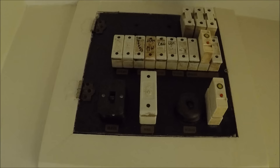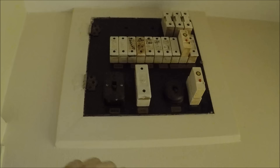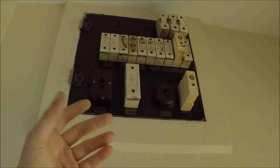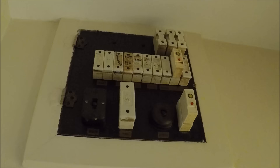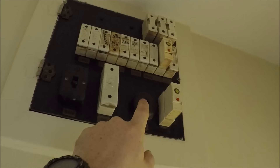Here's the old switchboard I'll be ripping out. What I want to do is flush-mount the new one so it's flush with the wall — the only feasible way is to rip the skirting off, which means some stopping and painting. For a customer, the cheapest way is a surface mount, which would stick off the wall about six inches. Next thing: count up what you've got, examine all the circuits and write them down. These hot water switches don't count as circuit breakers because their breaker is elsewhere.